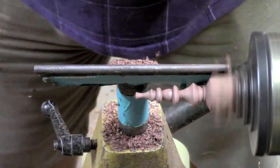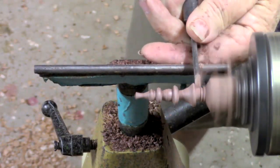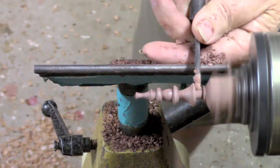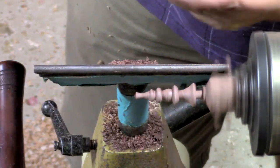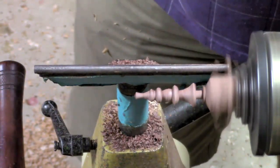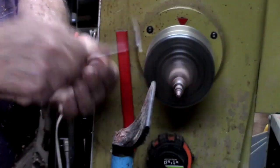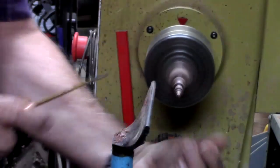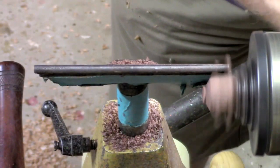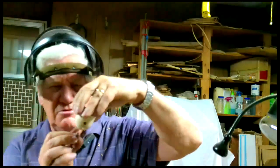We'll go to measuring again. You just got to fit in a 1/4-inch hole. Take a 1/4-inch wrench, file the bottom down. Don't do that on a CBN wheel. You put it on there, it'll do your final trimming. It'll be exactly 1/4 inch. Okay, so that would be our finial, that if we put a flat, drill the hole, would just fit on the bottom here. You know, where the camera is.